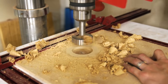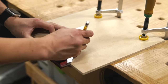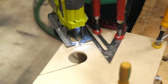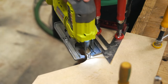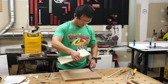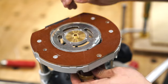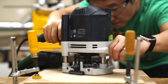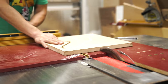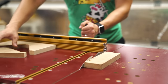While they soaked, I began to work on the form. First, I made a quarter inch template by cutting a hole that's close to the radius of what I'll be bending the corners to, followed by two lines cut at 90 degrees tangent to the curve. Next, I taped the template to a piece of three quarter inch MDF to produce the two sides of the form. By using a quarter inch bit and bushing in my router, I'll end up with two pieces that will perfectly sandwich a quarter inch of material in between them. I cut a total of four sets using this method, one for each corner of the box, and these pieces will become what I call the master template.